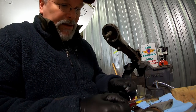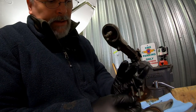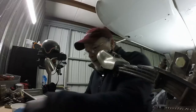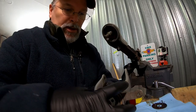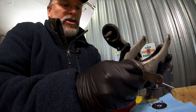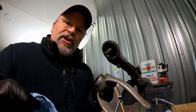But because of the extra weight of the tailwheel on a Stinson, there should be two extra springs that go into these locations that don't have pins. So, friction plate, take your springs out. And then here on the steering horn, what we do is we just grab this, give it a little wiggle, and you should see that piece come off. If it were cheese, it'd be Gouda.